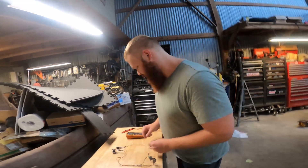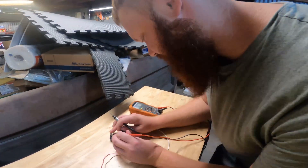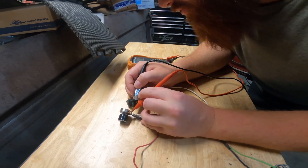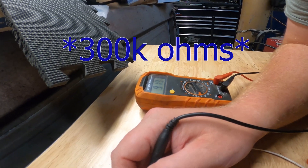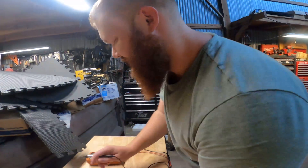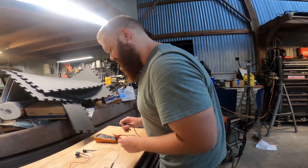So before we throw it in, we're just going to give it a quick test to make sure that the circuit works. First, we're going to measure the resistance off the potentiometer — figure out how to use the potentiometer. We've got it set at right around 300 right now. My shaky hands keep bouncing off, but right around 300. So we're going to adjust that. In the forums, if you read through them, you'll see that 300 is kind of a sweet spot for a lot of people. It seems to vary, but that's where we're going to start.